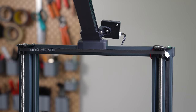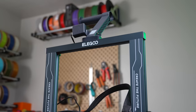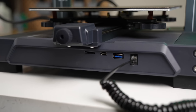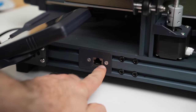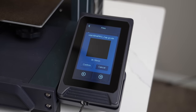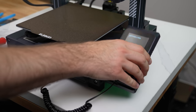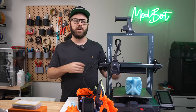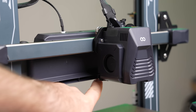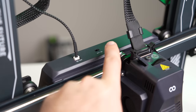Elegoo does have the Z motors connected with a belt which will ensure that they stay in sync. On top of the printer under the spool holder, there is a filament run-out sensor, and underneath the top extrusion is a PCB with LEDs to light up the printer's workspace. For connectivity, there is microSD, full-size USB, USB-C, and Ethernet. Interfacing is done through the 4.3 inch touchscreen on the front, which is responsive, has a stretchy telephone-style cord, and attaches to its mounting points with magnets. One very interesting inclusion is the four 4020 fans strapped to the back of the X extrusion, which add a ton of cooling and can be toggled off with a switch on top of their housing.